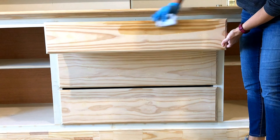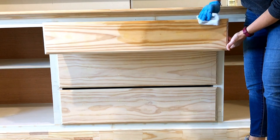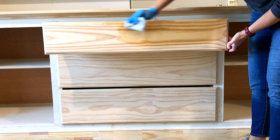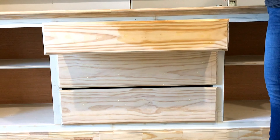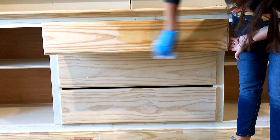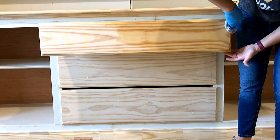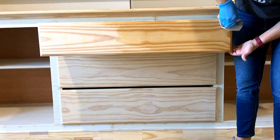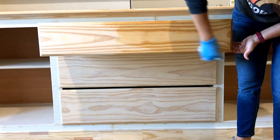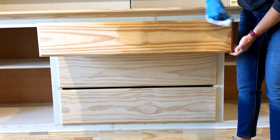Two more reasons why I love Danish oil: it doesn't leave any brush marks. Since it's a wipe-on, wipe-off product, you don't have brush marks left behind like I usually get with water-based primers, which always seem to leave brush marks. The Danish oil is quick and easy, and you can get it into the grooves of furniture projects really easily. It's also low VOC, so you're not going to be breathing in any harmful vapors when you use it.